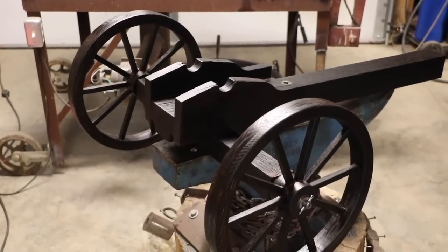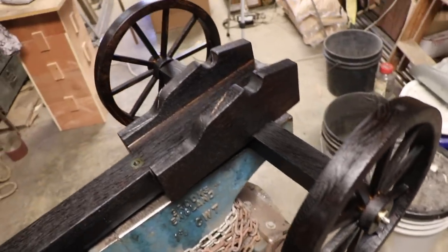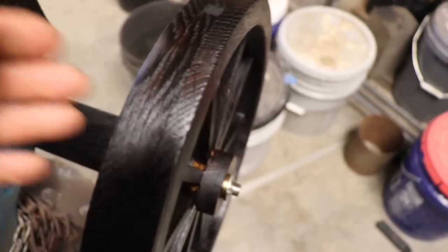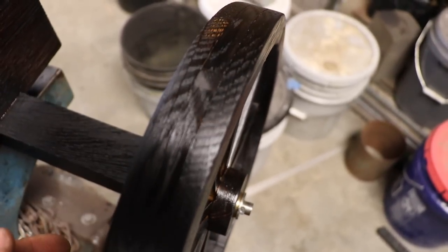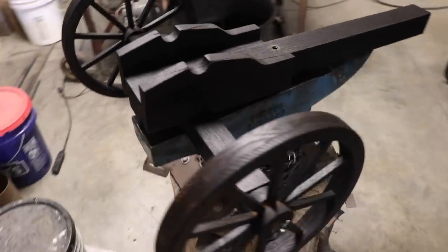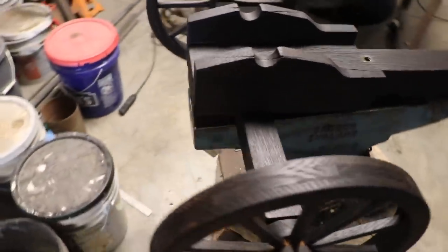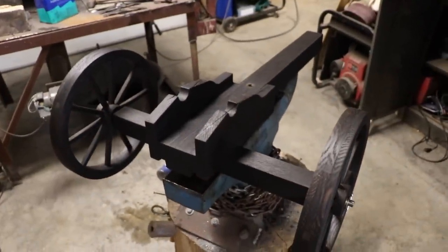So I put on two heavy coats and now I'm wiping it off with a clean dry cloth. And here it is after wiping it down. I had my doubts about burning this thing, but I'm really liking the way it looks. You can still see how it went together — you can see the individual boards — but overall it's a black carriage. Here it is after the linseed oil has cured overnight. I think that looks very cool. Way better than paint.